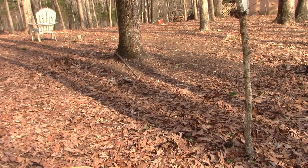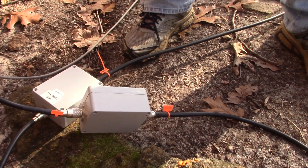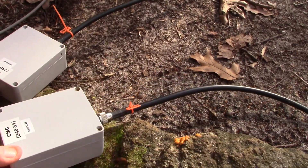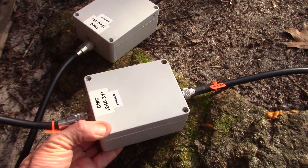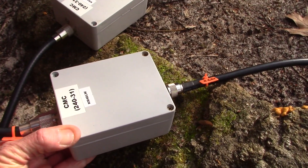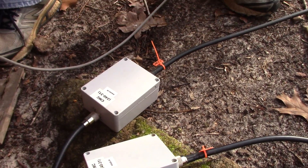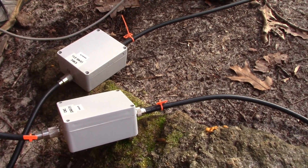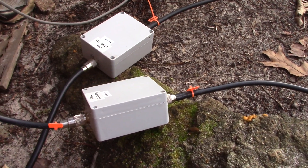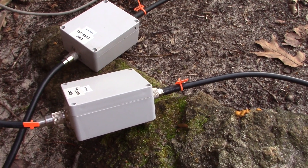Going into the wall — what have you got here? Well, a couple of common mode chokes. You can see there, maybe 240-31 mix cores. We had some issues last year with common mode and this has fixed that. And that's homebrew, not a store-bought one. Good deal.